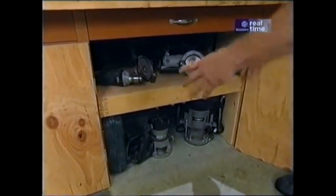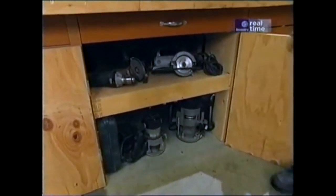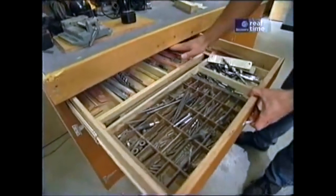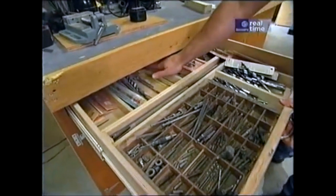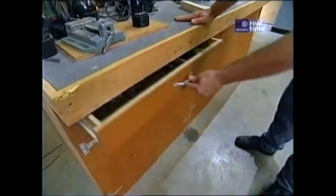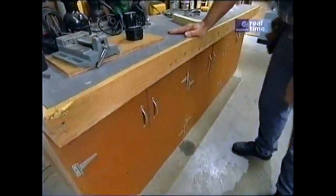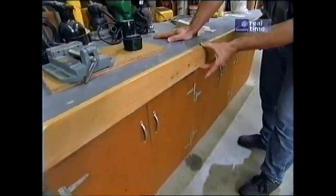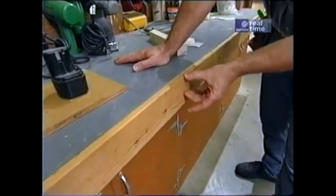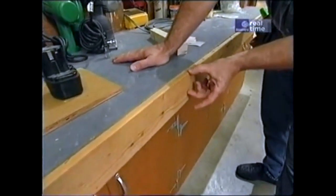So I think having full extension drawers would solve that problem. We like the shallow drawers at the top, but because of this overhang, some tools are hard to find, so I can improve on that. The height of the bench is perfect — it matches the woodworking bench — but this front edge is too massive. We thought we would clamp things or put a woodworking vise, and that didn't happen, so I think I can reduce that.